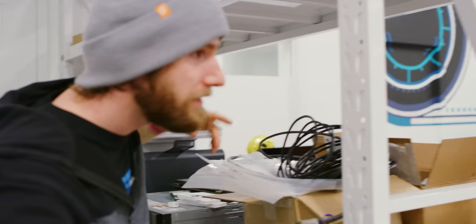It's very zoomed in. We got our test set up as fiber inspector. That's what we want here. So I just stick the thing on the thing? So yeah, did you pop the dust cap up? Yeah. Stick it all the way on. And then that ring there is to focus. Keep going. Stop. And so now that it's in focus, click analyze, and we can see that there's only one tiny defect, but that's within the specification and it's okay.